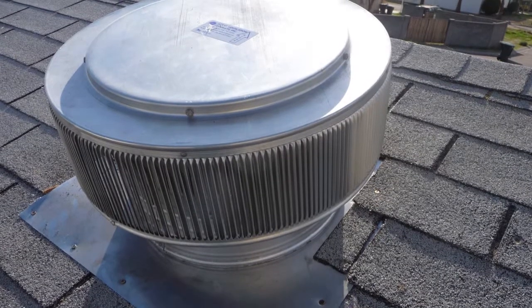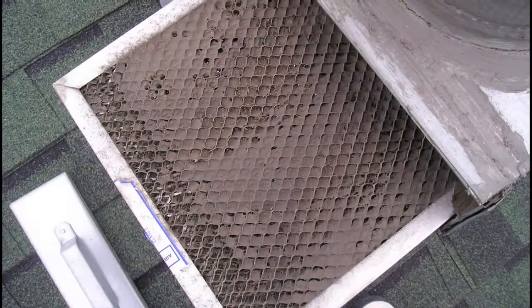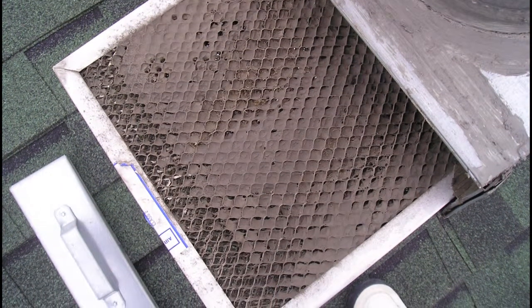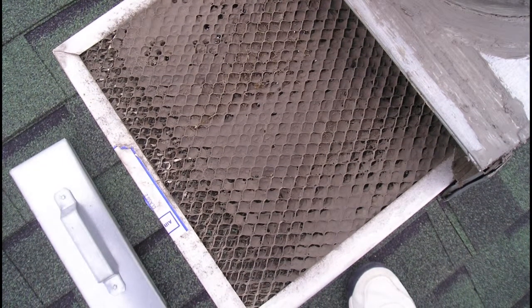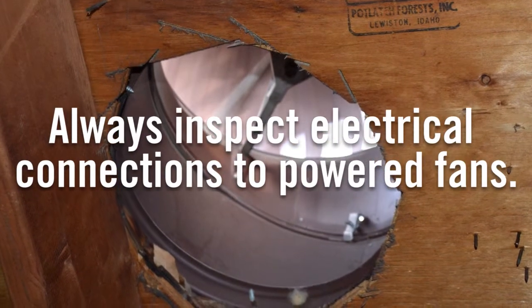You may also have an attic fan that helps move the airflow in and out of the attic. If your vents are covered, the fan can actually work against you, sucking cool air out of the house, using more energy, and making your air conditioner work harder. So keeping your attic vents open is just as important as the insulation process.